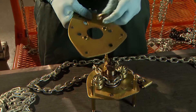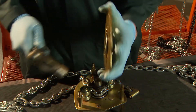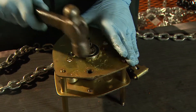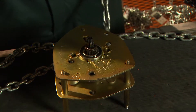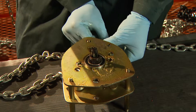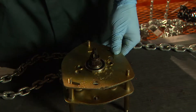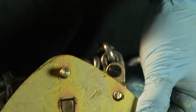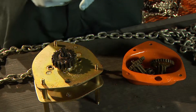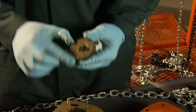Ensure components are properly aligned. Tap the double seal ball bearing into the gear side plate assembly. Tap the geared side plate into place halfway, allowing room for the chain anchor plate. Insert the chain anchor plate in between the plates. Make sure the chain is straight. Now tap the gear side plate the rest of the way down. Position the load gear on the load sheave and secure with a snap ring.